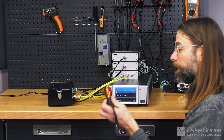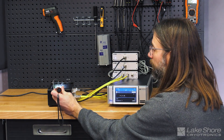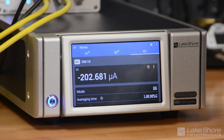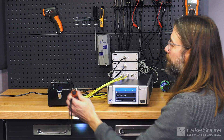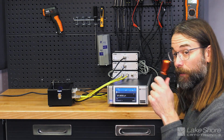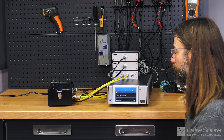Now I'm going to take a simple flashlight and shine it into the photodetector — this is basically simulating noise. You'll see I've got over 200 microamps now, and if I pull away the noise source I drop back down to 30 microamps. So this is saying: if we've got a DC source and we're making a DC measurement, then a DC noise source can create a lot of additional error in our measurement.